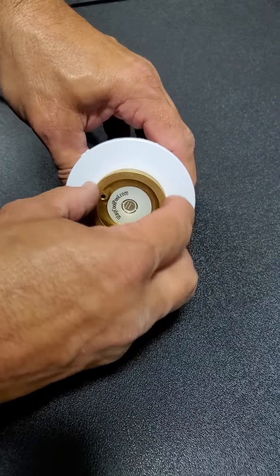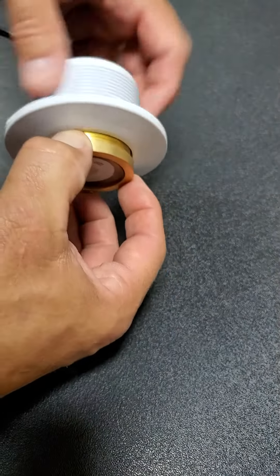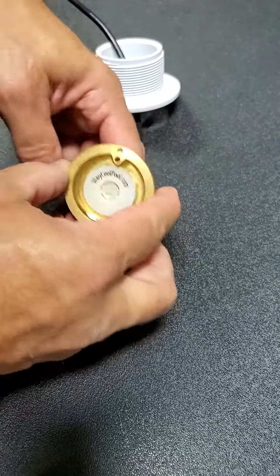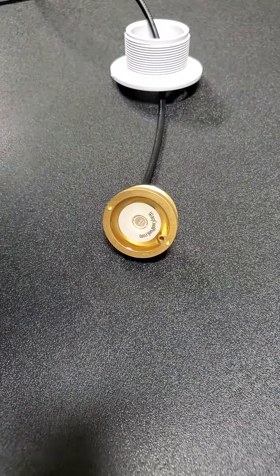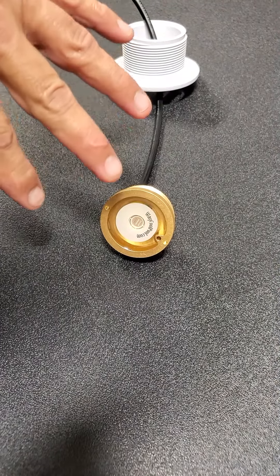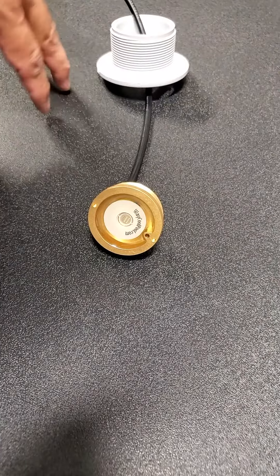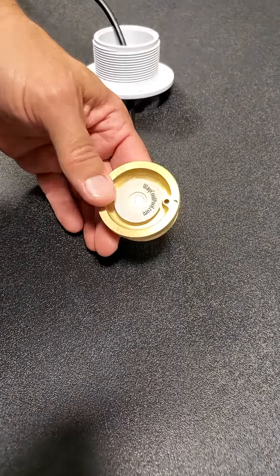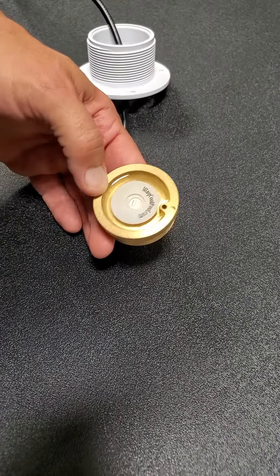This particular light comes with an RGB controller and it's 12-volt DC. The light can create any color you want — warm white, solid white, pinks, purples, orange, any color that exists. This light is going to be able to do it. The overall output is around 15 watts, and that's going to be on the white setting.